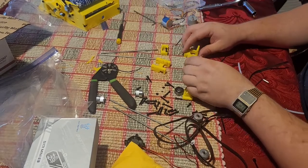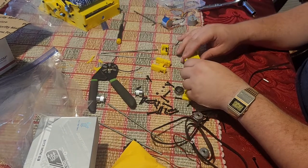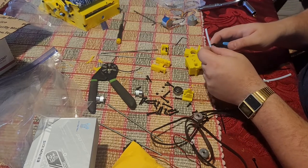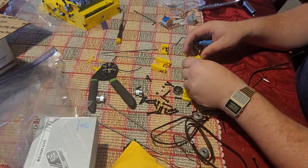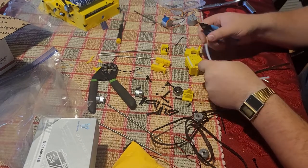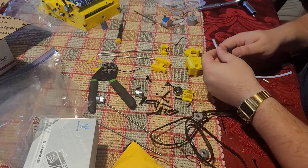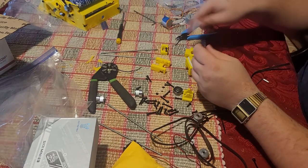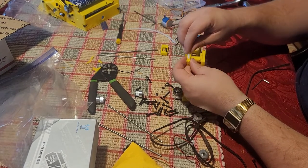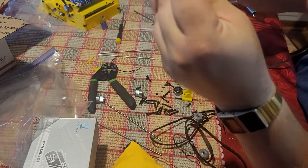All right. So, first thing we're going to do is take some PTFE tubing. We're going to cut it to length. And 9.6 and 9.7 versions and beyond should have little lips to help hold this PTFE tubing in so that it doesn't slide out. We've already added that to the Y slider here. There's little lips right on the end there to keep the PTFE from coming out.